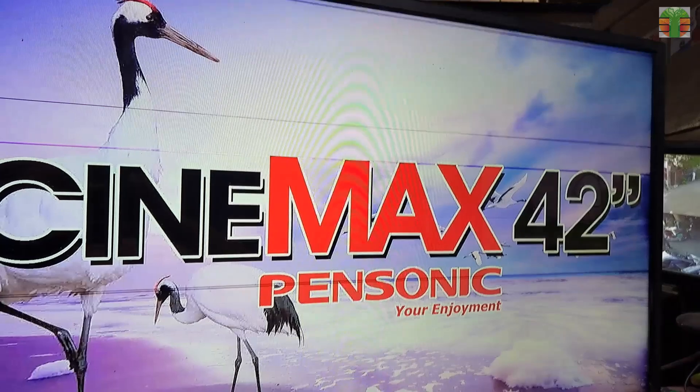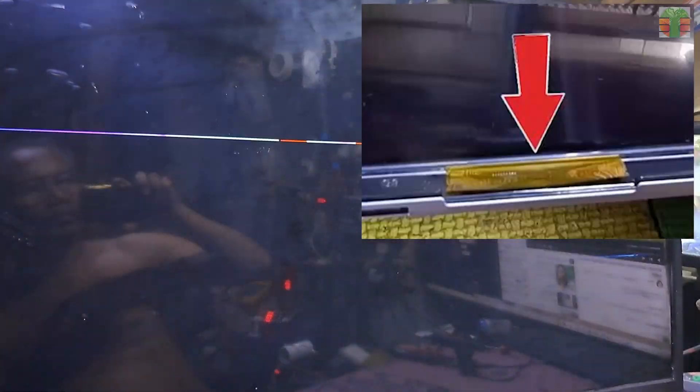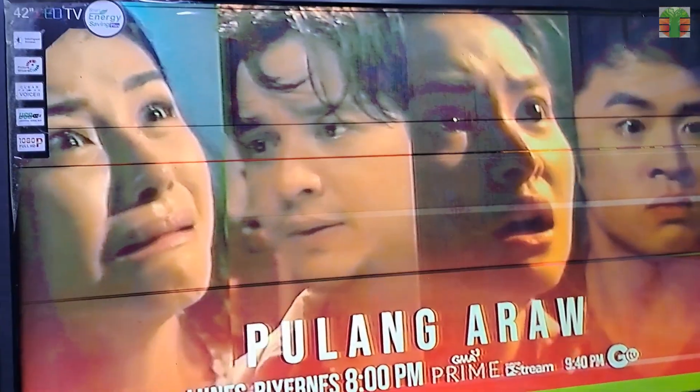The TV has horizontal lines that are not guaranteed to fix — it's a chip-on-flex defect. It has not been significantly repaired, but at least I showed you how to use a DC-to-DC converter as a VGH supply. Thanks for watching. I hope you enjoyed and learned something from this video. You can help this channel by liking and subscribing. Once again, this is Tefs — see you again next time, bye for now.